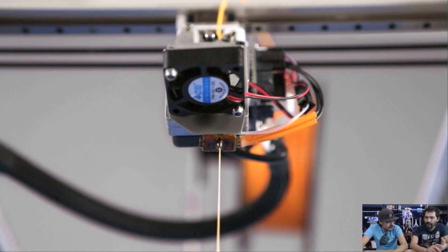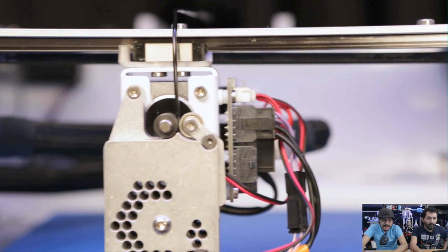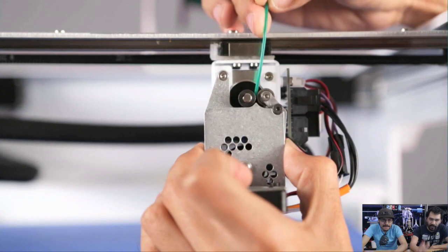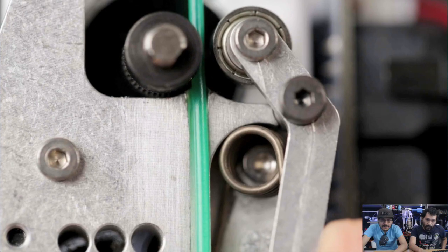They've tested things I've never even heard of, like magnetic stuff, some steel, some iron. They have PLA, like Plus, PLA Platinum, IGUS. They have a ton of materials that they've been testing on this, and they have all the profiles up. And of course, our favorite material works right out of the box here. There are no modifications that we need. It has a pinch wheel, so you can print Ninja Flex, Semi-Flex perfectly. It also has a very comfortable spring-loaded direct drive system going on here, so it definitely works with most of your filaments.